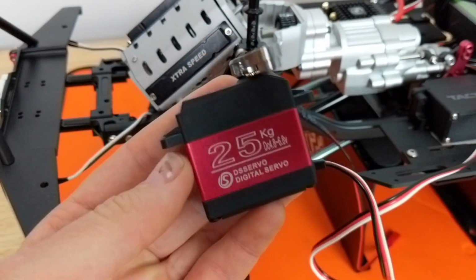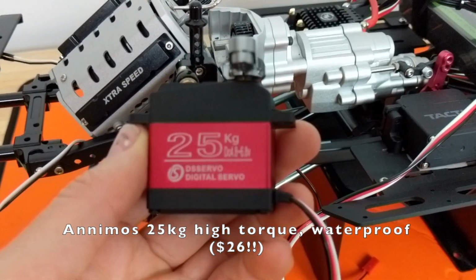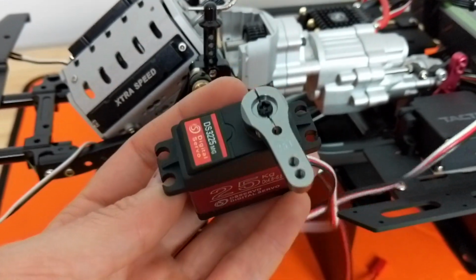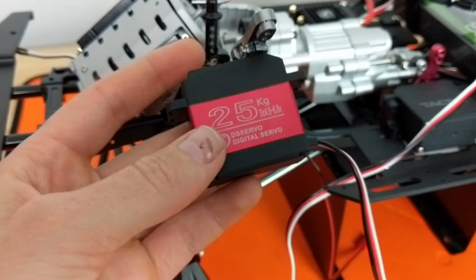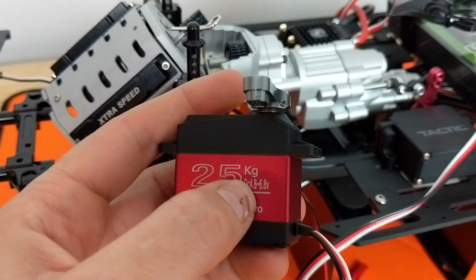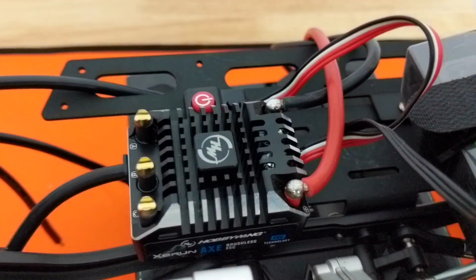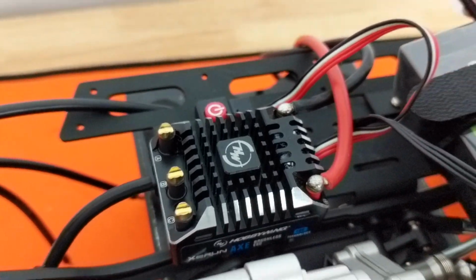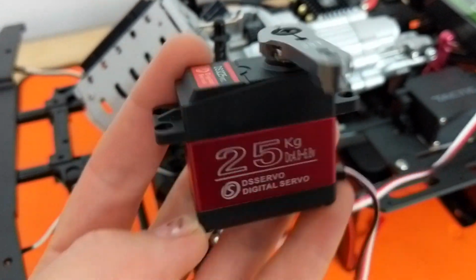This is what I ended up picking out for my steering servo. I have a couple builds going on right now, and so expenses get a little bit crazy when you're picking out some really high-end servos. So I just found this on Amazon. I'll put a link in the description box below, but it's supposed to be a pretty high torque servo. It can function on 6.8 volts, and actually the ESC that I picked out, you can use Bluetooth with your app and you can set the BEC voltage, which is kind of cool. So this should be pretty good.